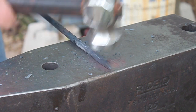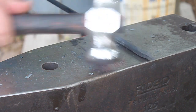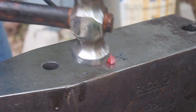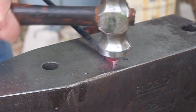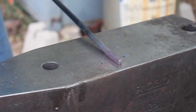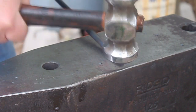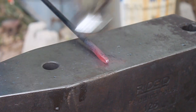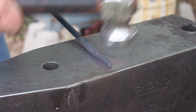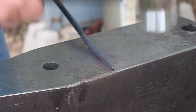I don't know about these voiceovers — it's kind of hard to look at the video and talk about it as you're watching it. I did that other point. Now this is the other side, the side that's going to have the little finial there, the little curlicue. Again, go to square and then start drawing out a point to it. And as your metal gets colder, just work a little bit lighter. Heat it up again.